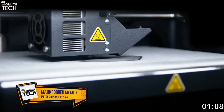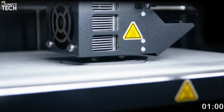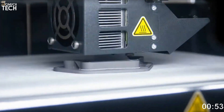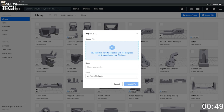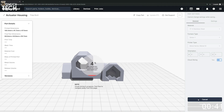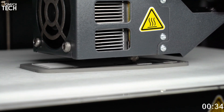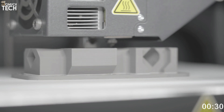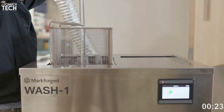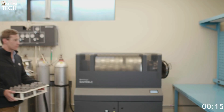Number 5: Markforged Metal X. The Markforged Metal X is an easy-to-use machine that boasts a small footprint and slicing software with printer and print management features. It promises to make your parts fully functional in as little as 28 hours, from design to printing. The Metal X uses the atomic diffusion additive manufacturing (ADAM) method of metal 3D printing, which entails using a bonded metal powder filament. Individual workstations sinter the final components after placing them in a debinder. With Markforged's three-year success plan, the printer's $115,000 price tag means the whole Metal X setup can cost upwards of $150,000 — and this doesn't even include the two post-processing components. To ensure a clean breakaway post-sinter, the Metal X prints a thin ceramic interface layer between the supports and the part, using the primary metal feedstock as its support material.